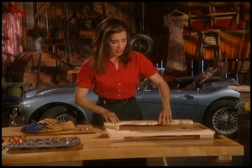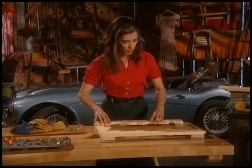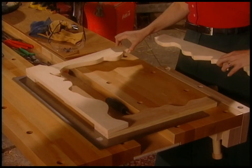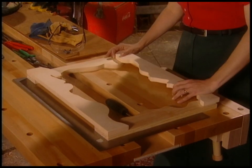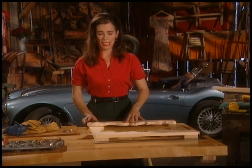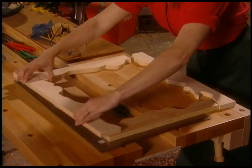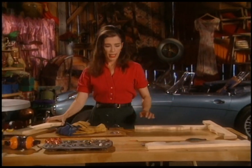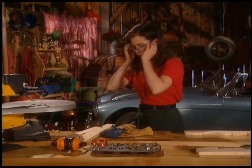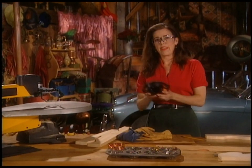And there's a lot of subtlety in these lines. I'm going to cut those bits out of the side pieces so that this piece just drops into place, then screw from all four corners and the screws won't be seen. Then back to the scroll saw, just make four nice passes, and then we'll glue the thing together.